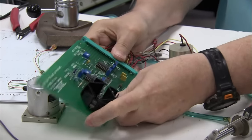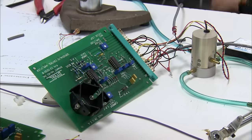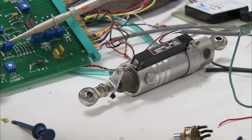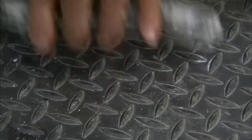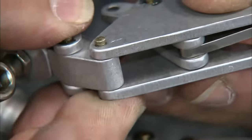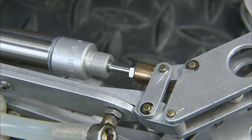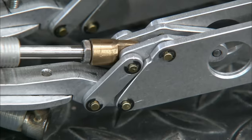An electronics engineer tests a control card, which will control the motion of each animated component of the figure. The card is connected to an oscillator tester to verify that each cylinder responds accurately to the electronic input signal, and a computer programming the card's memory allows precise control of the cylinder's motion. The cylinders act as muscles to create motion, while the aluminium frame functions as the skeleton to support movement. The cylinders are connected to the metal frame, with each cylinder dedicated to a specific function. One cylinder activates a finger in the hand assembly, allowing it to curl up with a smooth, seamless action.